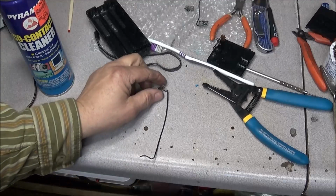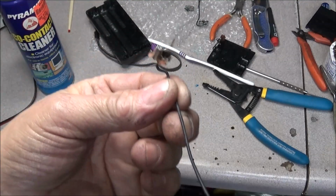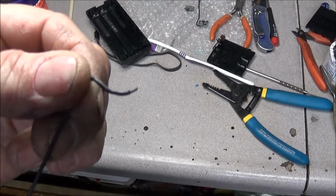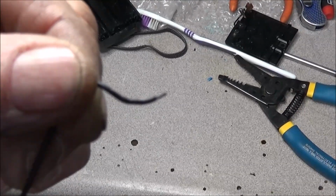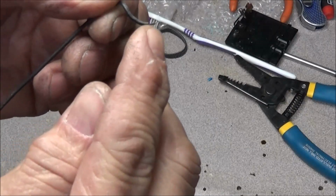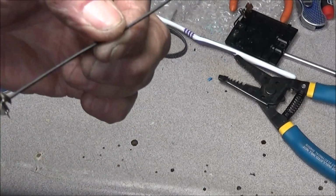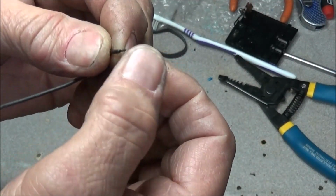So you can see, this is when problems come in. This one connector is nice, good and clean, but the wire that solders back onto the adapter, I don't know if y'all can see that, I've got it stripped back, and even cutting into the wire it is black. So what happens is this corrosion has wicked right on up this wire, so I'm going to have to cut this whole wire off and resolder on a new piece, because it could be breaking down some way inside too. But yeah, that is black.